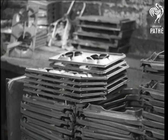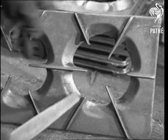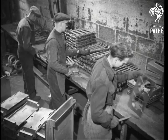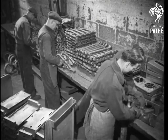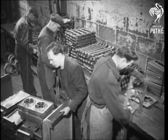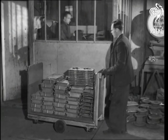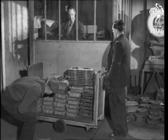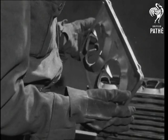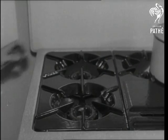At the beginning, in the pattern shop, we saw work being done by hand. And now, at the end, in the fettling shop, we again see work being done by hand. He is trimming up a cooker plate with a file. Other cooker parts on the bench at the back are also at their finishing stages. As batches of cooker plates are finished and ready for enamelling, they are removed on a trolley for weighing and inspection. We have followed the processes used in making these small castings: first a drawing and then a pattern; pattern, sand, and box in two halves made a mould; iron was melted, poured into the mould, it set, and the plate was taken out of the sand and made smooth. And so the finished article, like thousands of others cast in iron, finds its way into everyday use.